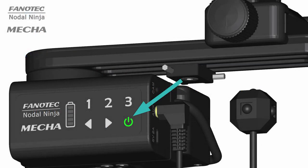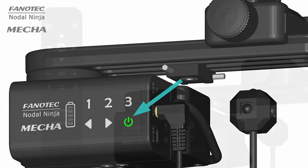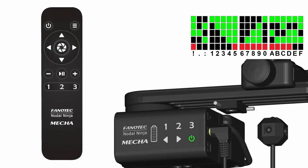The LED under the power button of the C1 controller keeps blinking during the test. With the commander button functions deactivated, MECA no longer executes remote control commands. Instead, when you press a commander button, MECA beeps and shows on its LEDs the code of the pressed button after the button is released. Each button has its own code. If the LEDs of the C1 controller show the code of the pressed button, it means that the button is working properly.